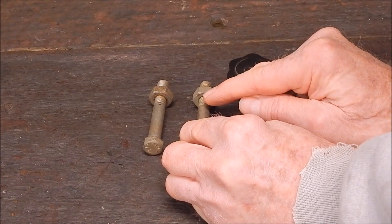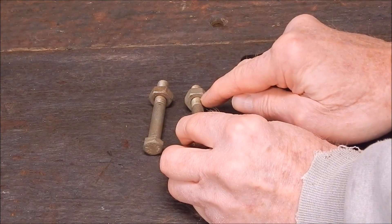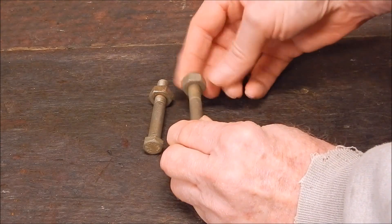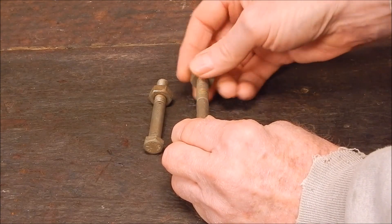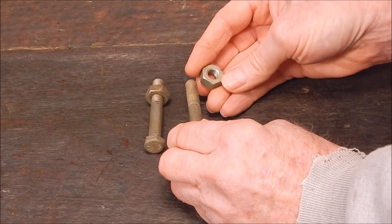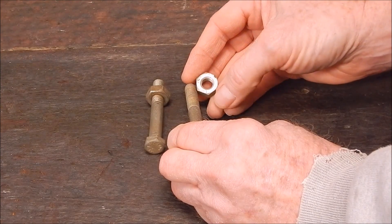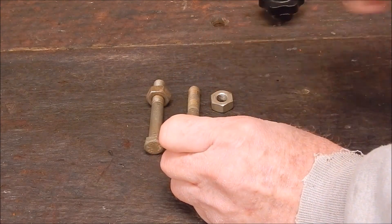It's the way to go in my opinion, because with this sort of job you just run the braze into the back of the nut and it will capillate into the thread. What I'll do is drill out the back of the nut to put a little recess there before doing the job - I'll do that in the lathe, just put a concave on the back of the thread entrance. That way you don't have to put a ton of bronze in, it'll just flow into that little taper and then you can machine it back clean afterwards for a perfectly flat face.